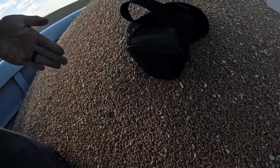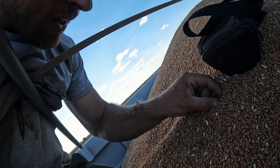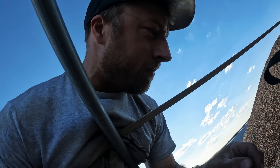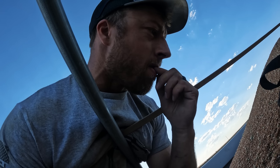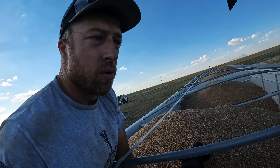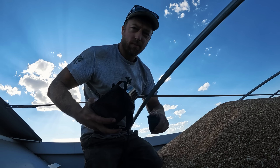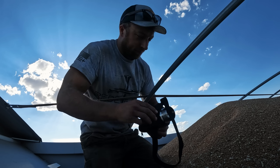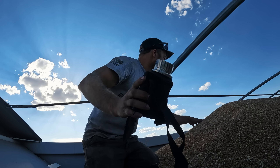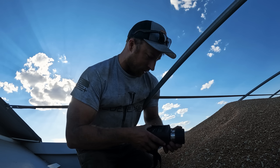First thing I like to do is stick my arm in it. It's hot — 95 degrees out — so the heat's been absorbed in there. Second thing I like to do is look at the colors. I am seeing some green berries. Green berries mean high moisture, we don't want that. We want it to be nice and hard and crunchy. But there's a lot of it that is ripe, so it should blend down. The bin we're putting this in does not have forced aeration, so we've got to be careful.